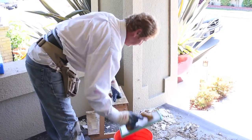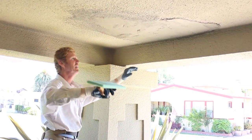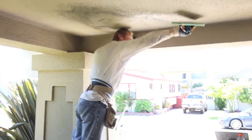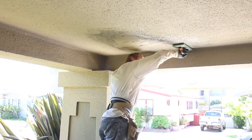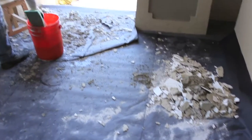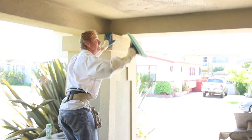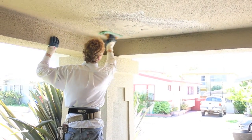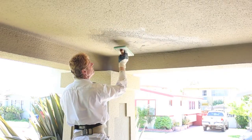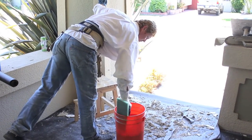Now that this one is setting, we'll take a sponge with water. We got our perimeter joint first — I don't want to put my sponge dead center yet. I want to get these joints coming in. Of course we're always multitasking — Jay's mixing and actually on the camera. A lot of mess just to do a little patch; you've got to cover the whole floor, pull off the stuff. So we got that perimeter — now we're doing this perimeter just like that. The feather needs to go real well. Now I'm going to work my interior, the body of this. A lot of water because it's a medium dash finish but a heavy, heavy float.